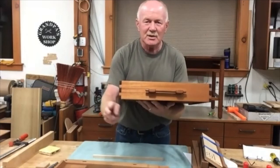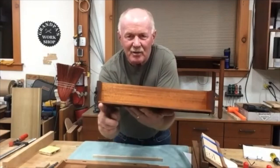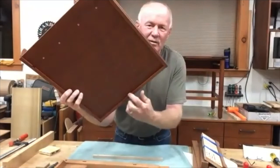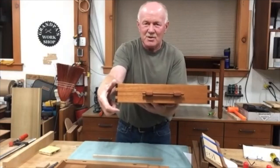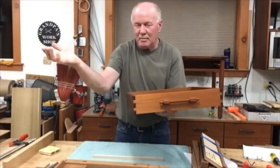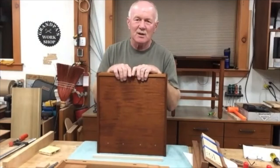So we can raise the bottom. We put the drawer bottom up higher, leaving a deeper gap at the bottom behind the drawer front to hide the Blum undermount runners. But again, you have to sacrifice 5/8 to 3/4 inch on the bottom of every drawer. Maybe not a big deal, but it all depends on what you use the drawers for. A lot of factors to weigh out. There's no one easy answer. It's just what are your priorities?